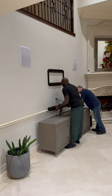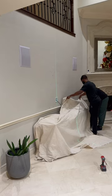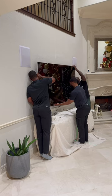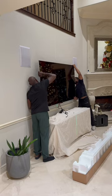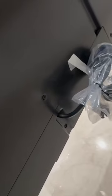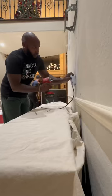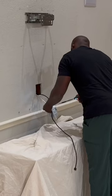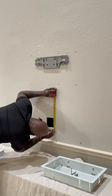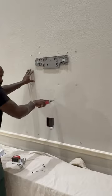He didn't want the soundbar mounted, so we're gonna take that down. Take the old mount down, find the middle point between these two speakers, which was 41. Installing this mount is very easy, nothing crazy, but we do a test fit — we're gonna sit it on there and use a pencil to mark where the bottom ends, because that cord is at the very bottom and it's thick. So we're gonna take that out and put our own box in, and end up taking a power bridge out of this. This next part is probably the most difficult — just getting the numbers right for where this box is gonna sit, because too low and you'll be able to see it and have to redo the whole mount.